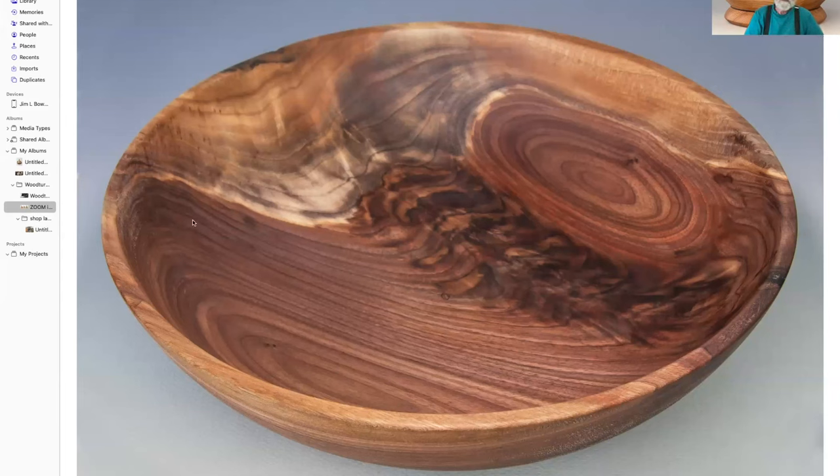So, yeah, I think there's a whole list of things one can do when it comes to tear-out in end grain, and you've heard most of them. There's no magic to it, I'm sure. But I think the suggestion to reduce the feed rate is probably the biggest one. Cut less, not hog enough. So the idea there is that the chisel is presenting to the fibers more often and not jumping ahead so fast. I got you. Yeah.